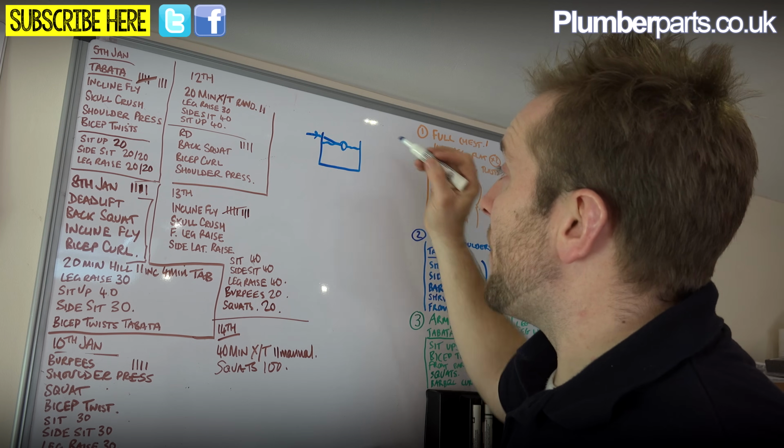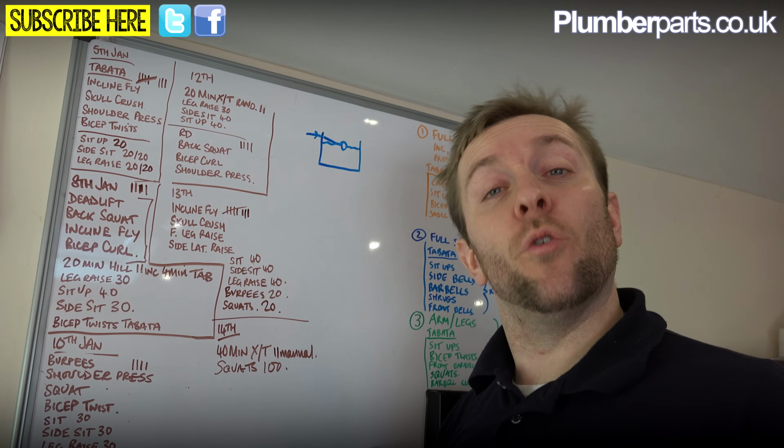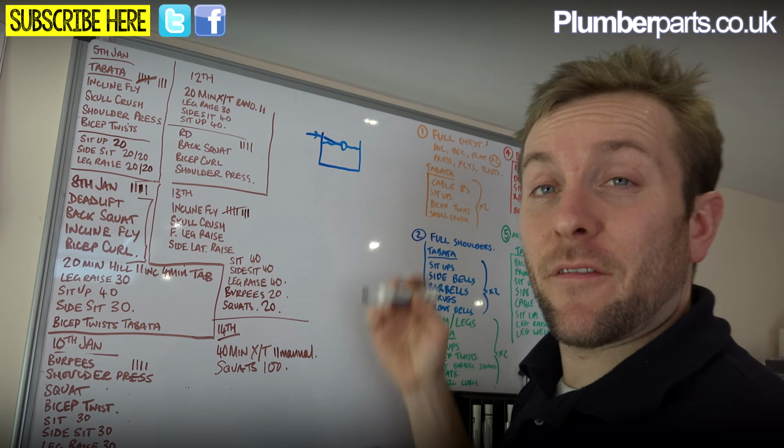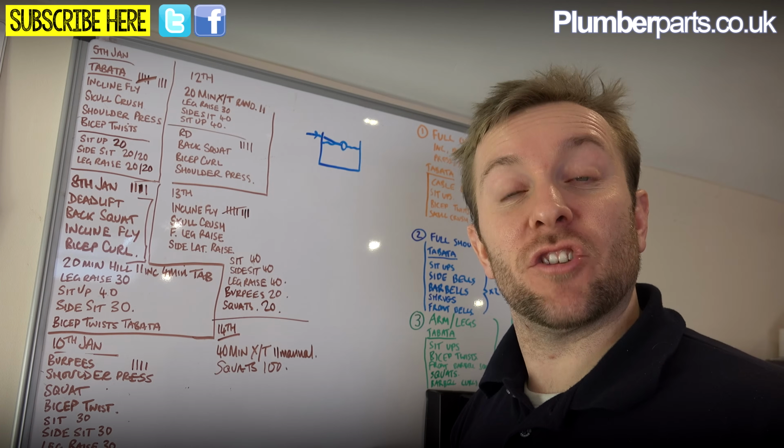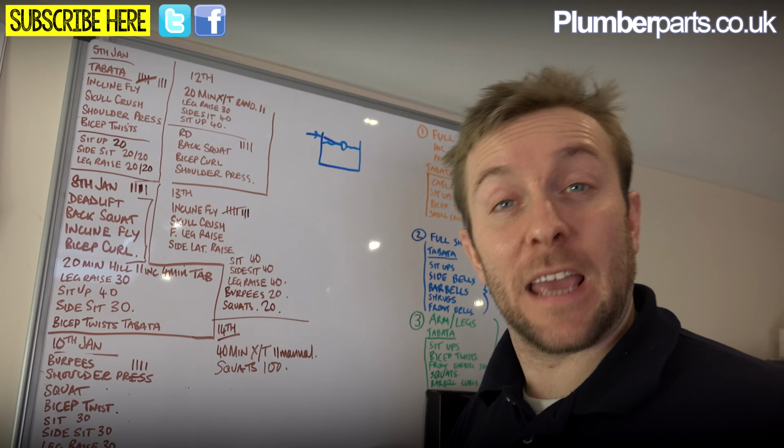And really what you've got to make sure about when you're thinking about if you're going to install one of these is whether this tank's going to have enough water to serve your shower pump, and whether your cold water main's going to have enough pressure in it to keep that topped up so it can keep on serving it.